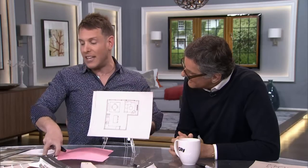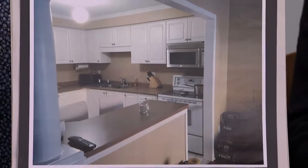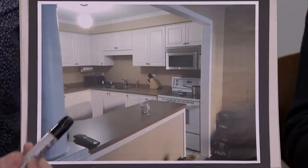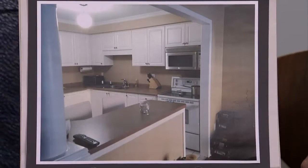In terms of styles, Kylie was saying her kitchen cabinets are peeling because she's been in the house for 12 years. What a lot of builders do is use thermofoil, which is almost like a sticker on your cabinet — over time it starts to peel from heat. You can absolutely reface the kitchen rather than redo the entire kitchen, and that'll save you money. It'll carry over for the next couple of years until you've saved up to do it properly. I would also update the backsplash — maybe some stone.